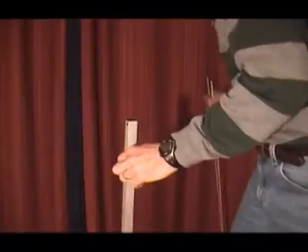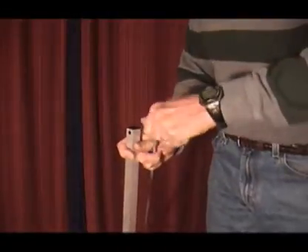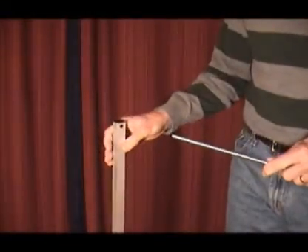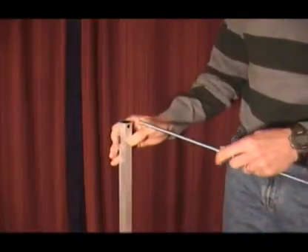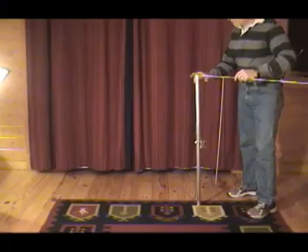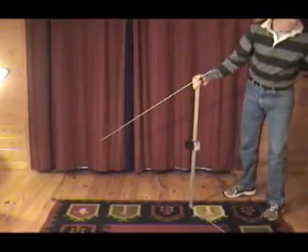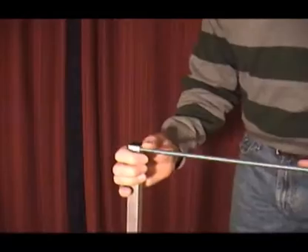Now we're going to take one of the five-sixteenths radiators. This is the way it comes from the factory with a vinyl cap on it — we're going to remove this. Which side you insert the tube on is going to depend upon how you're going to use the antenna. If you're going to mount it on a tower, you want this mount on the outside. But for any other application, you're going to put the tube in on the same side as the mast clamp. It's a very tight fit, a smooth fit. All our holes are milled; there's only about one one-thousandths clearance. We'll take the second five-sixteenths tube and insert it — about one inch is all that's needed.